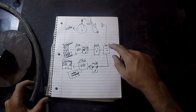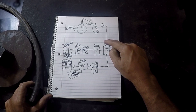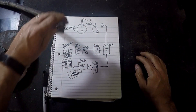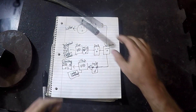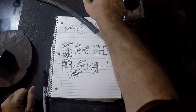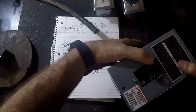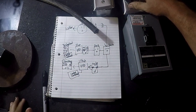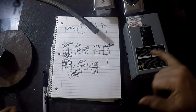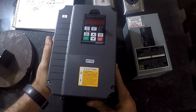What am I doing currently for this? I'm going to create a temporary line that goes from here and just plugs into this 50 amp, and that's what this wire is initially for. I'll come down into this 30 amp and connect over to this 20 amp 220. The 30 amp will go into this switch breaker box that has a 30 amp breaker in it, which will power the 10 horsepower VFD.